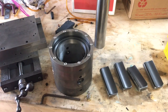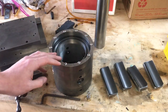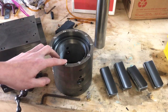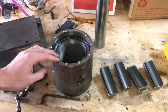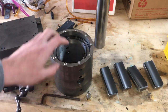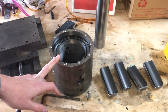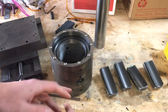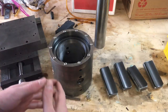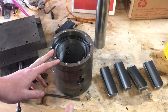So that's pretty much everything. All I need to do now as far as the spindle goes is just make the axial bearings, put those in place, make the thrust faces for the shaft itself, get those put on, and then it'll be just about ready to go. As usual, if you have any questions, just put them in the comments — I enjoy answering them there, and there are often a lot because I forget to mention things in the video. There'll be some clips after this — I'll voice over them and explain what's going on. I hope you enjoyed it. I'm having a lot of fun doing this project, but it's also kicking my butt, so I'll keep working on it. Thanks for watching.